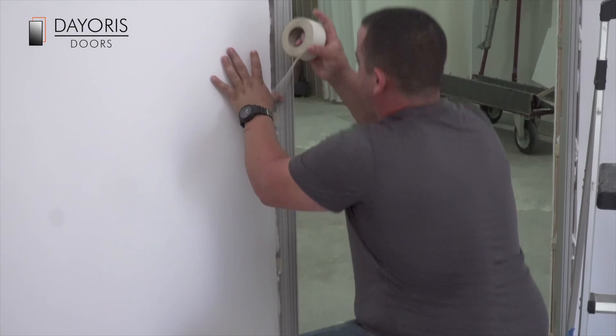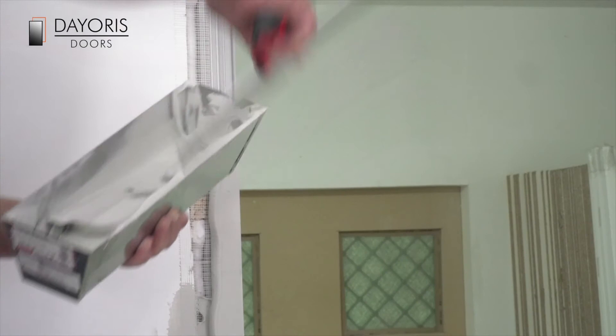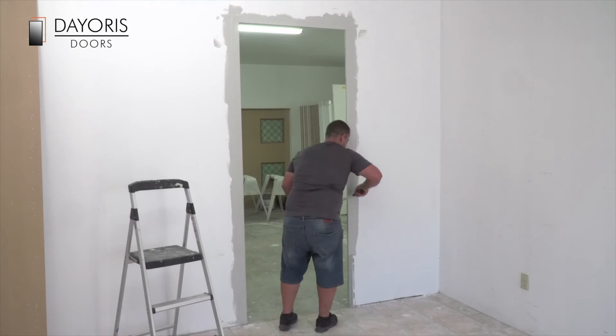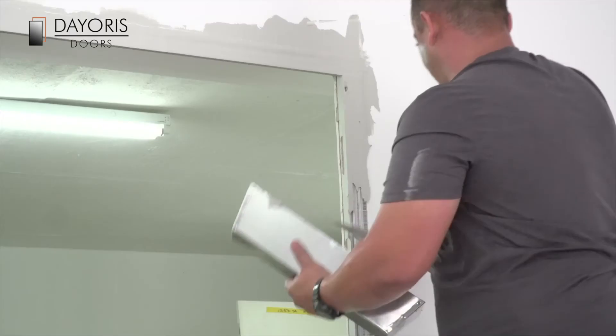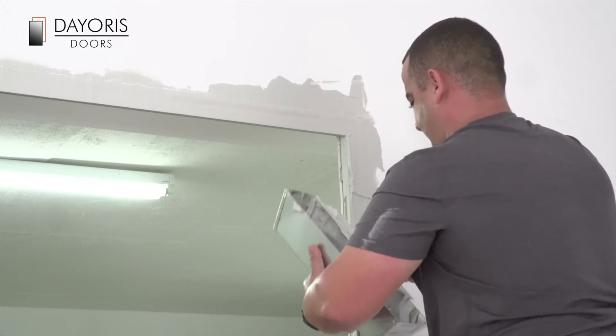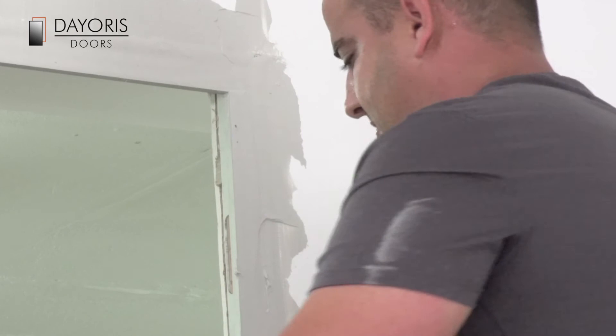Flush to the wall, front side. Apply mesh to the joint where the 2x4 buck meets the aluminium frame. Once the tape is applied over the transition joint, you can begin to float the first layer of compound over the entire area. The edge of the aluminium frame is cut with a 45 degree angle to form a mud ring to terminate the compound. When you finish the compound against the 45 degree mud ring, the result will give you a perfectly straight, razor thin line. Make sure that you don't put too much plaster on at one time. The proper finishing technique requires 2-3 hand passes in order for the plaster to build up and cure properly without cracking.